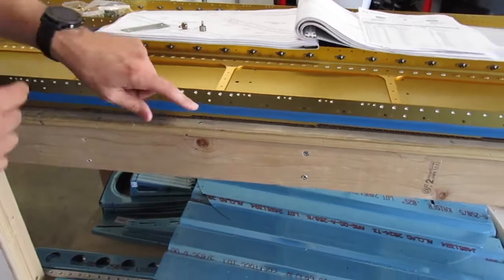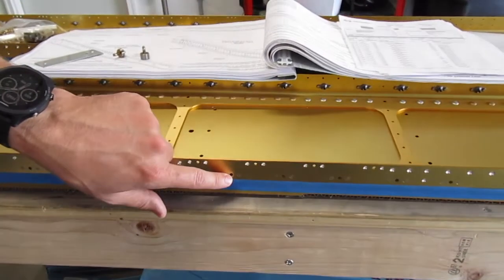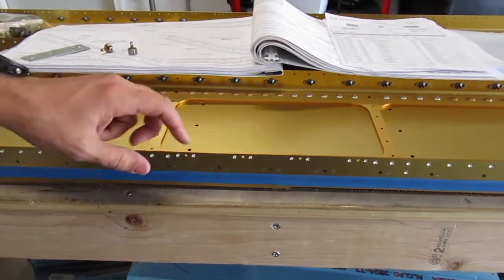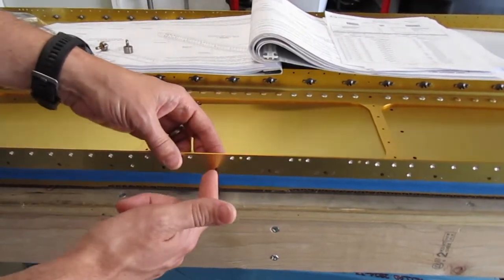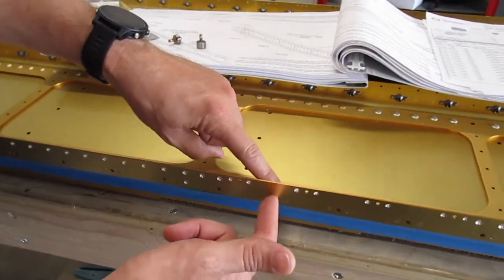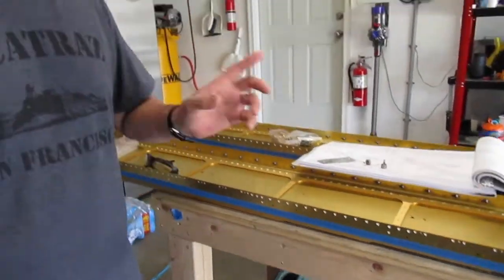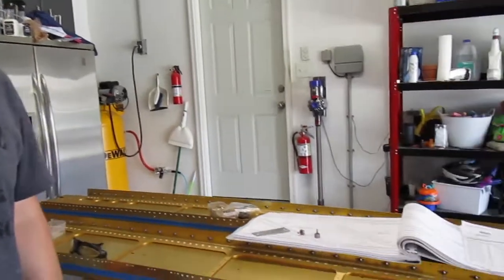And this is actually a pretty cool thing. Vans, I think just by happenstance, the nut plate fits a number 30 cutter pretty well. So the nut plate itself holds the countersink bit and keeps it perfectly centered. So you can make nice, round, concentric countersinks for the tanks.